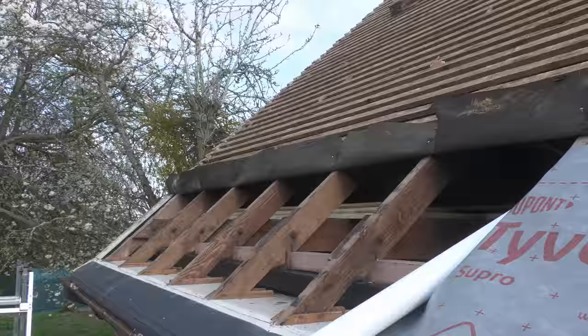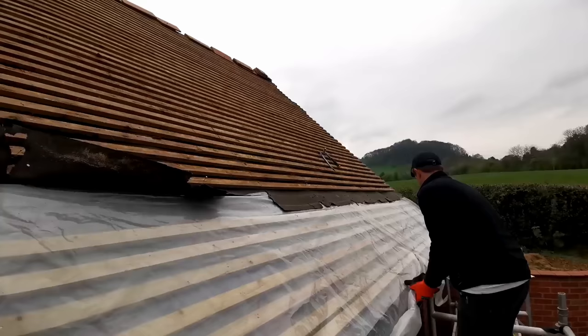This wasn't ideal, so what I ended up doing was pinning up the old bitumen felt and cleaning it away each batten as best I could with my leaf blower, then teasing the individual shards down between each layer of felt with a tap. I then attached a layer of polythene on top of the new battens and felt so that when I released the folded-back bitumen felt, all the shards could harmlessly slide across and onto the floor. I didn't film that as it was a bit of a low point.